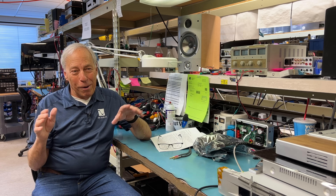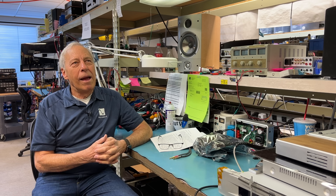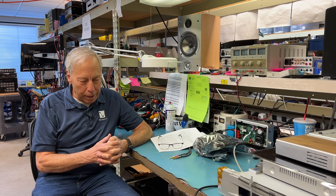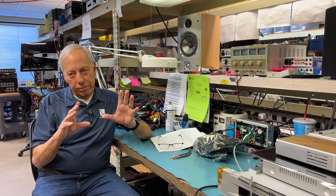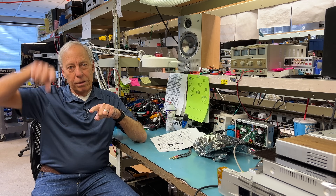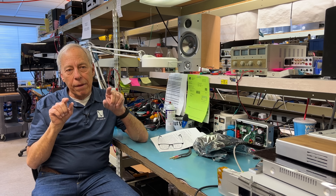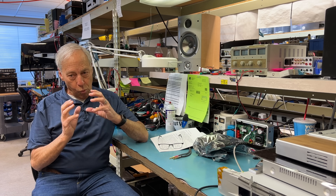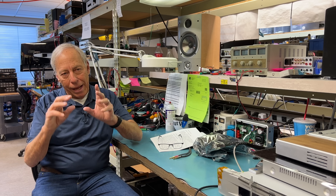Now, I'm not going to say see you tomorrow, because people say, what do you mean? Nobody talks about voltage — everybody talks about wattage. I'm going to see if I can do this in a very simple way that makes sense. Trust me: what you need out of an amplifier is voltage. Same thing that comes out of a preamp — voltage. Power amp — big voltage. 50, 60 volts sometimes, 30, 40 volts. Lots of volts. It's the voltage that energizes the coil in a woofer or the coil in a planar magnetic to make it move against the permanent magnet. That's all voltage.